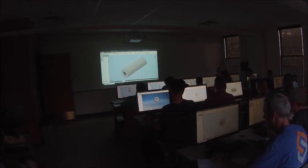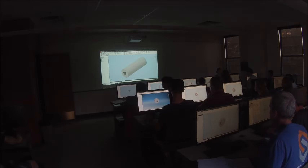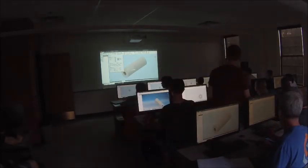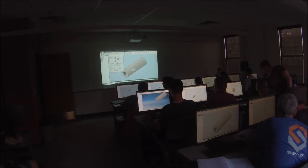Did you select the right thread? Did the depth of each of the holes default to 0.536? Oh, termination. Right here where it says termination, that should be distance, not through all. Yeah, I'm sorry, that was the first thing I said.